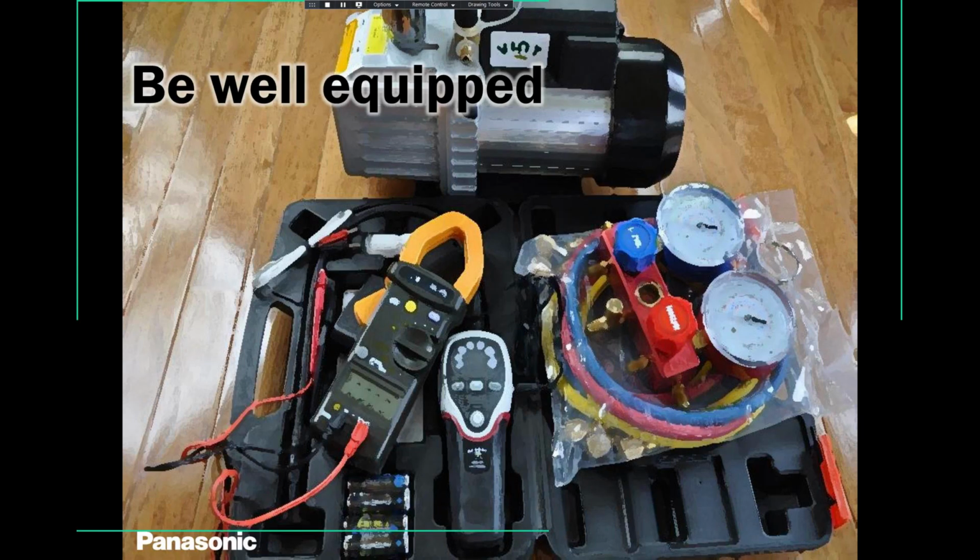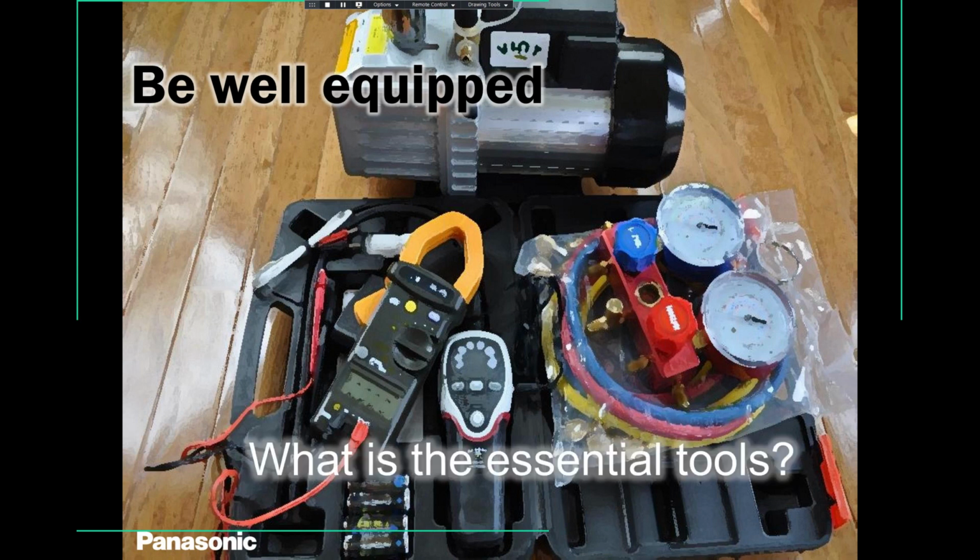You have your vacuum pump, your amp probe meter, and other meters here, humidity sensor, whatever. Your gauges, don't mix your gauges, please. If you're working on various equipment with different refrigerants, please don't cut corners. Cutting corners is not good. It's a short-time fix, long-term problem. So please remember, use your gauges well, use your gauges correctly. You will never have issues.